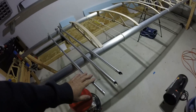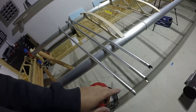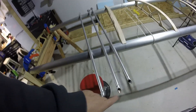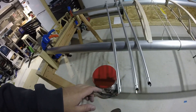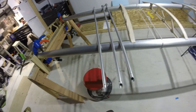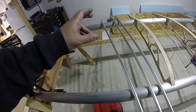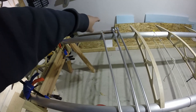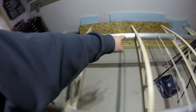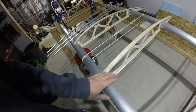I've removed all three of the drag anti-drag tubes. I have them labeled for their orientation, direction, and which fitting goes where. I drilled all five holes for each end on the bench and deburred all the holes — can't deburr inside obviously, but I can get this little guy right here. Then I hit the outside with the Scotch-Brite pad. My plan is to clean this up with acetone, etch, and alodine. Then my plan is to bond and rivet one end of each tube, slide it back through the floating rib, and then rivet and bond the second fitting on each end before I attach any of them to any spars.